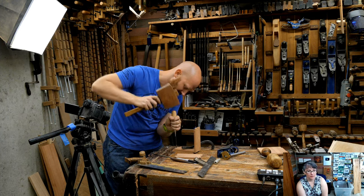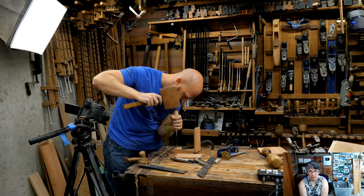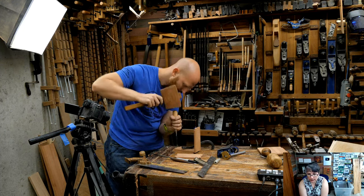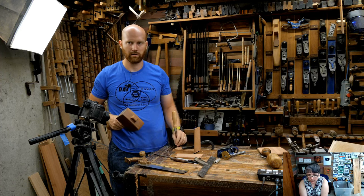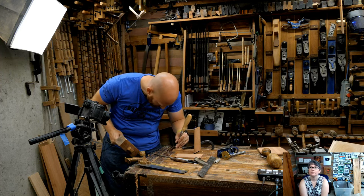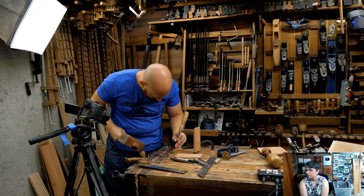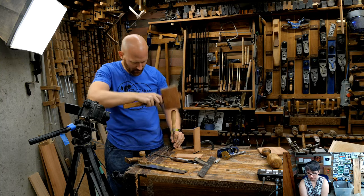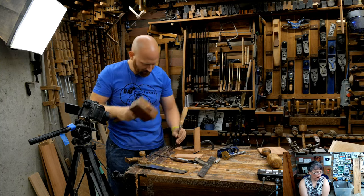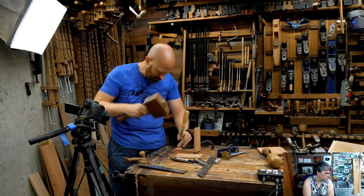Sorry, what's next? So Nick Gaspard asked, I have one of your marking knives, but need to enlarge the handle holes slightly. Any tips, because I can't get through with the drill press, and I think the entire thing is hardened. Yeah, I'm assuming you're talking about the knives from Tay Tools. Yes, they come hardened. They should come with the pins that are the appropriate size, so you shouldn't have to open those holes up at all.